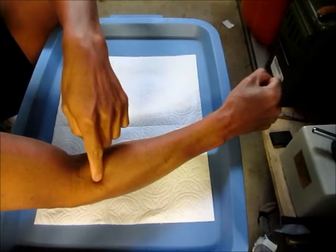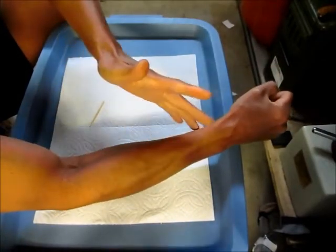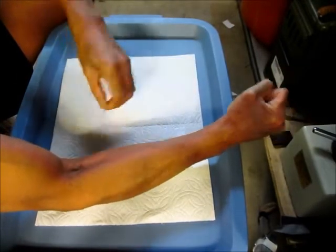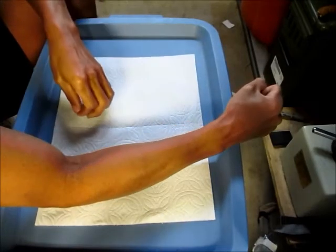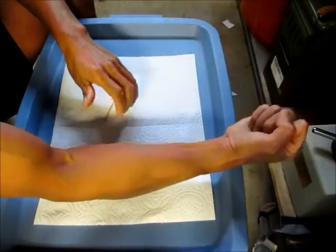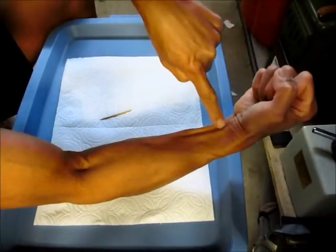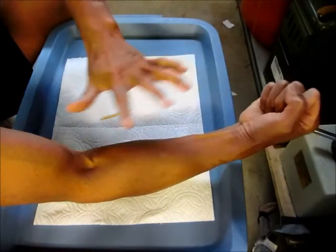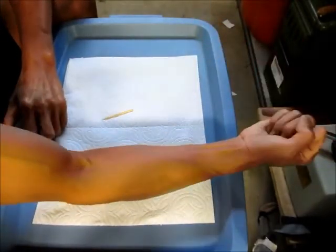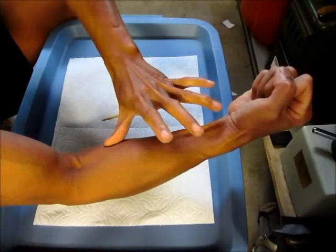The hardness changed because the stress on the material changed — this is similar to steel. Steel can be in a stress mode or a dislocation mode. You might test it and get high hardness, and that's why a lot of blades at high hardness are brittle — they're under stress. My total strength is 100 pounds, but if I'm already holding 50 pounds, I can only add another 50 before I break. If I relax, I can lift a full 100 pounds — that remaining capacity is the load.